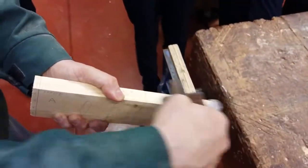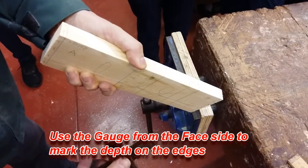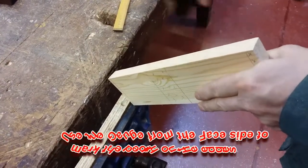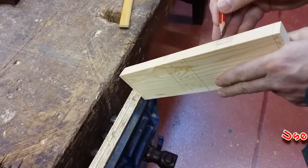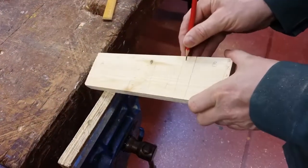I'm going to mark this onto the edge. I've taken it out from the vice here and I'm turning it so it can be a little bit easier to see on the camera. Make sure that you work from the face side — this is just from the opposite side but I'm still working from the face side to mark onto the face edge. Of course, indicate the waste on this as well.